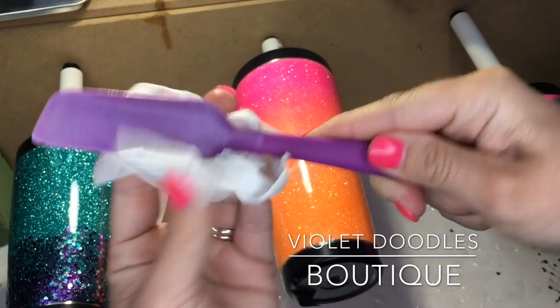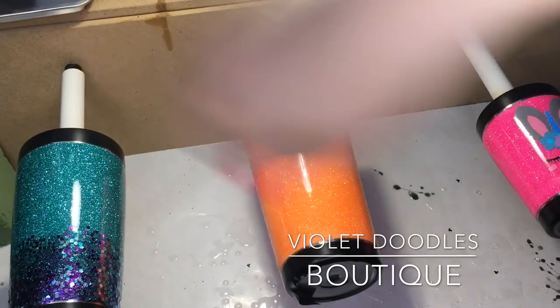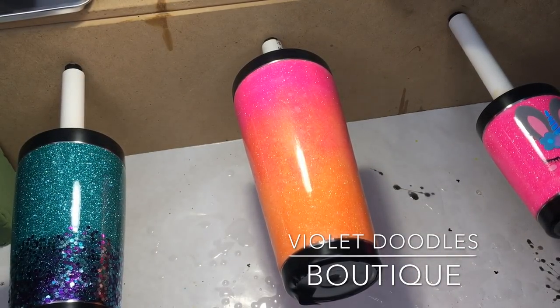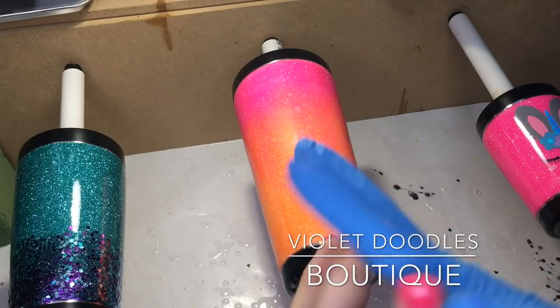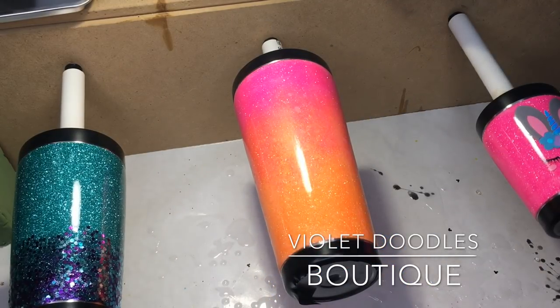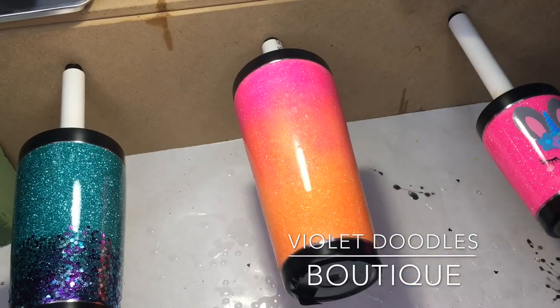You can also wait for it to cure completely and peel it off, but I'm impatient so I'd rather just clean it now and get it over with. When you're working with epoxy, it's really important that you understand the dangers that go with it — it is a chemical and you are creating a chemical reaction when you mix the two. Gloves are a necessity; these are nitrile gloves. You should also research different kinds of respirators, because breathing curing epoxy is toxic even if you can't smell it — it's still in the air while you're working.